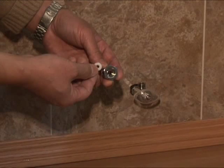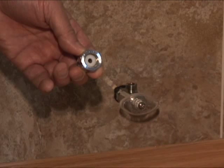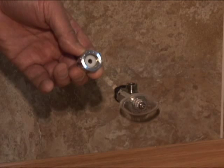Introducing the Uspa 6035R bidet seat. Installation. First, connect the spare nut to the water supply tap below the toilet. Ensure that the white washer is in place. All parts are included.